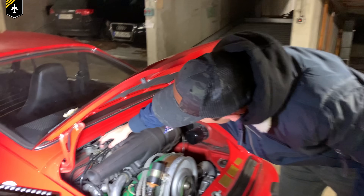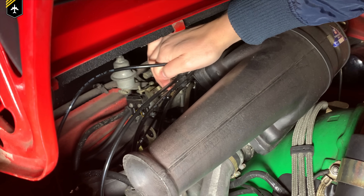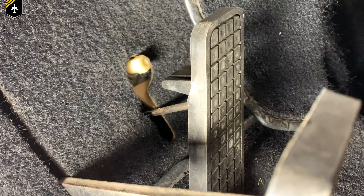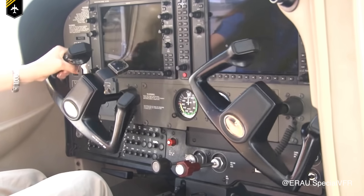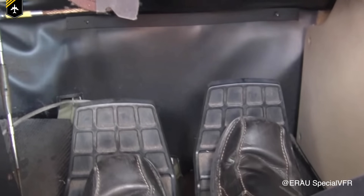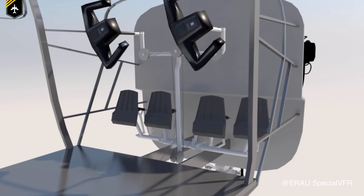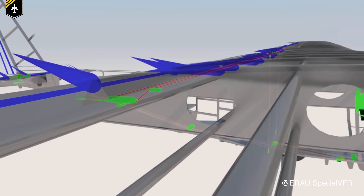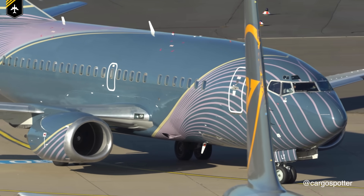This is not an airplane, but my car's engine. What I want to demonstrate here is the mechanical linkage between the gas pedal and the carburetor. If you push and pull on this lever, I'm moving the gas pedal from back here, showing there is a direct link or a cable between the two. The same construction applies with the flight controls in the little Piper or Cessna — as you move the yoke, cables and pulleys move your flight controls respectively. This type of flight control architecture can also be found in airliners such as the Boeing 737, 747, and many more.